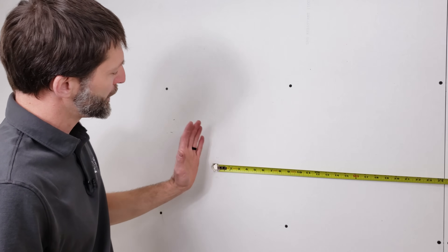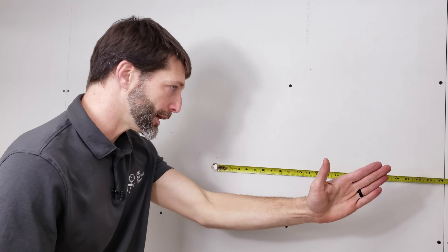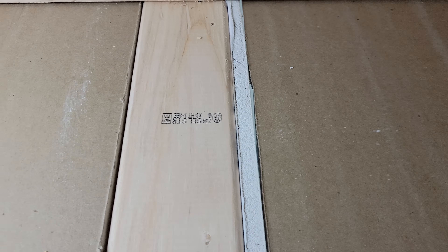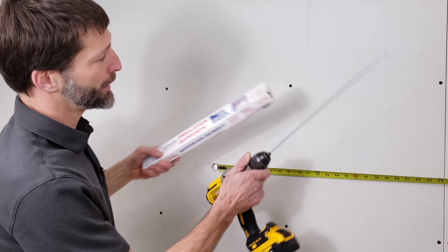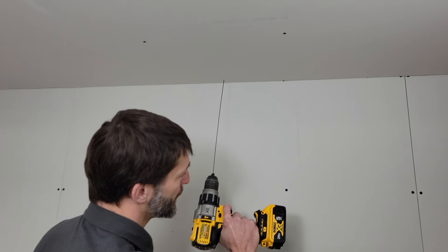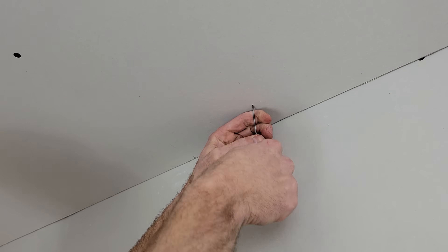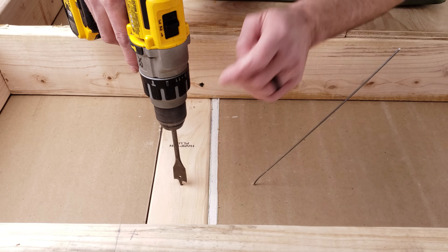The next thing we need to do is find a reference point for when we go up in the attic in order to drill down inside the correct bay. We could measure from here over to the attic entrance if it's a fairly straight shot. You could also look for grills or lights in order to reference — you can see the top plate up there in order to drill down. But if you don't know where you're at, worst case scenario you can use an insulation hanger, drill up through the ceiling, and just patch that tiny hole when you're done. Here's our probe — we can see our top plate, so we know this is our bay and we're going to drill our hole.